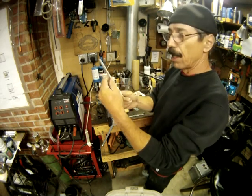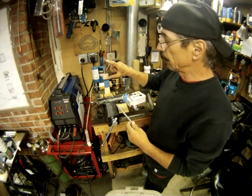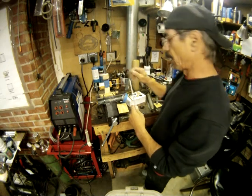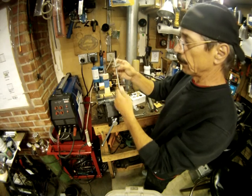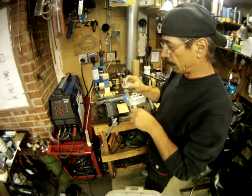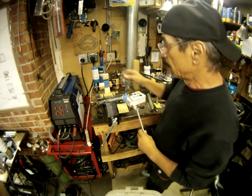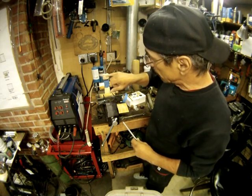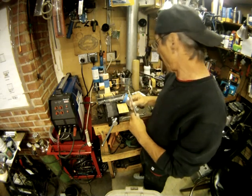I took a piece of threaded rod, and I pre-fitted this to see how many I needed, and then I ran those over this rod and tightened them down with nuts and big flat fender washers on both sides. I let it sit for a couple of days. So these are actually smaller in width, thickness, than they were originally.